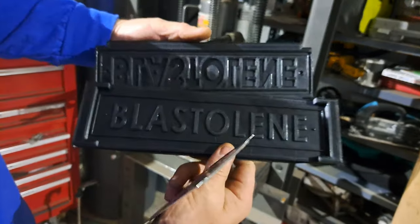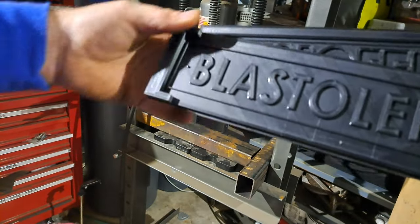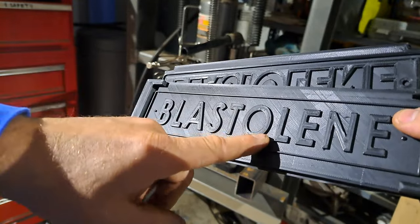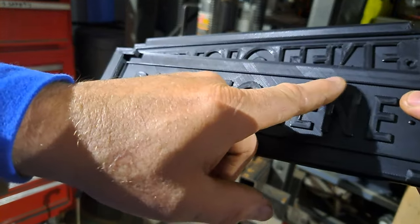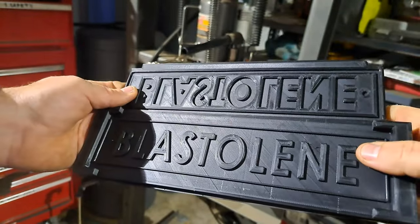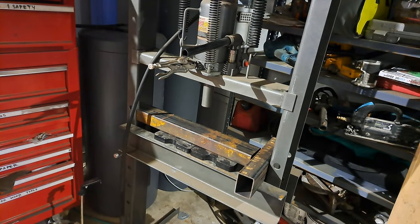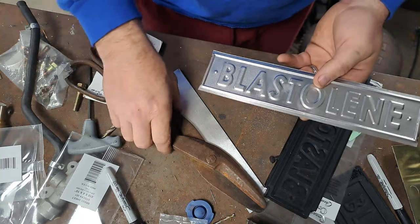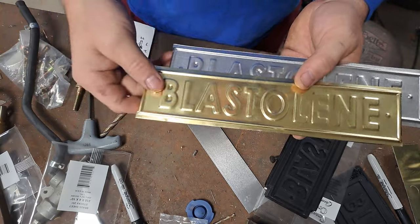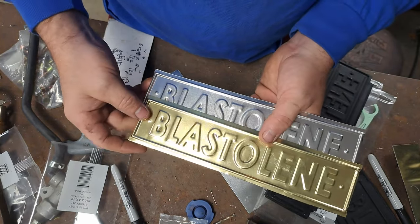And then the dies, they had a little bit of cracking going on, but they don't seem to wear too much. You can see there's a little bit of shininess around the outside edges here, so it looks like it's polishing and pressing the corners, but everything held really well. So we'll try some brass and then we'll see how that goes. Okay, so off camera, I actually tried some brass, and ooh-wee, it was a little bit harder, but it looks just as good. A little bit more cracking on the dies. They seem to take it pretty well.